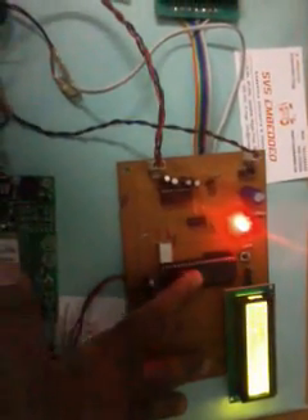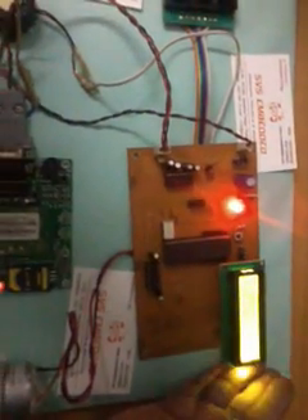This microcontroller is the AT89S52, ATMEL 89 series 52 chip. It has 8KB flash memory, and we dump the program using an AVR ISP programmer. Port P0 is connected with a 16x2 LCD display — whatever program is dumped onto the microcontroller is continuously displayed on the LCD. We are communicating through MAX232, which is a level converter for voltage level adjustment, so the GSM modem and PC can communicate together. P0 is also connected with a 4x3 matrix keypad — a telephone-style keypad.